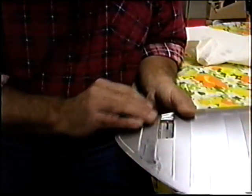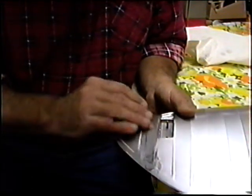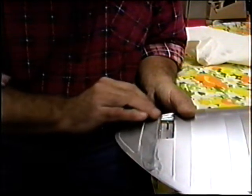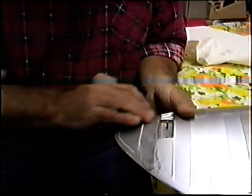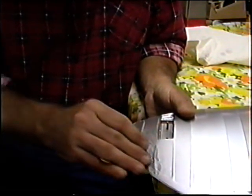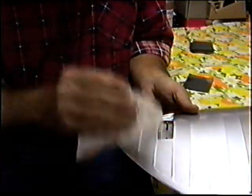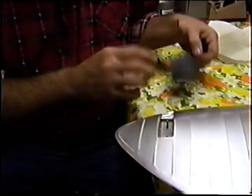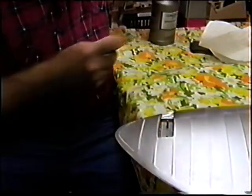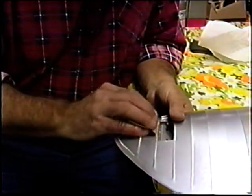You want to keep the material wet. Once this dries out, you're not going to make a lot of progress. You see how I'm in a puddle of this material. And it's the fact that it evaporates so quickly that makes it very practical. Now, as soon as it becomes like paste and it's not liquidy, get rid of it right away. Now, we're about halfway done. I've used the other piece of the sandpaper. Now I'm using the other edge. I'll start with a new edge. So I'm constantly rotating the paper.